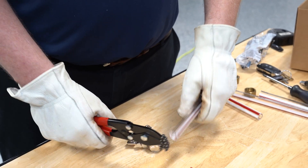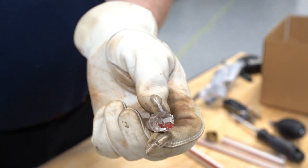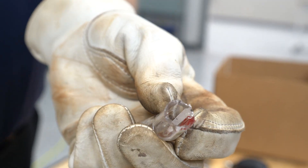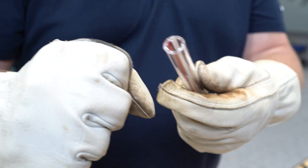and then we just squeeze, we won't get a clean cut. We'll have crazing and stuff on the inside, and we may even have a jagged end on it. So we want the squeeze and snap to give us the best end possible on a piece of glass.